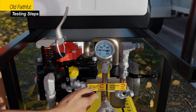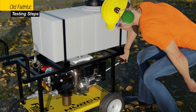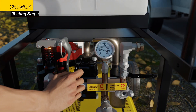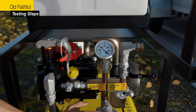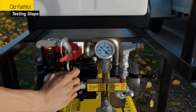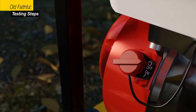With the pressure release lever in the raised position, start the engine. Once the engine is running, move the pressure release lever to the required position that was determined at the start of the test. Now slowly open the pressure control valve so that you can run the pressure back up to the determined pressure amount. Once the desired pressure is achieved, slowly close the high-pressure valve. This will isolate the pressure in the water main.